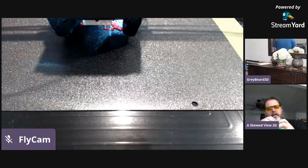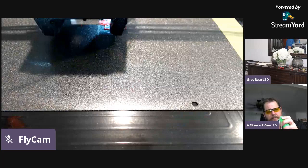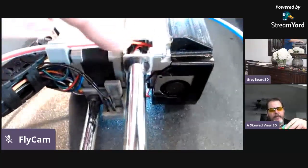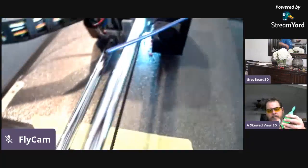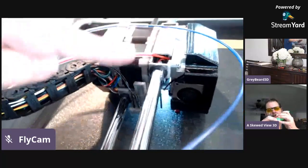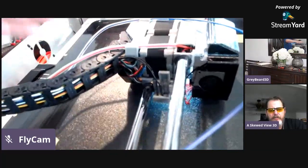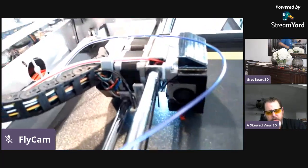It's going to be a big mess, so don't tighten it up. Yeah, whatever. Of course, it is only a little keychain, so how big a mess could it be? So there's where the filament feeds in. I'm not a huge fan of this path. It seems like it tugs it right over the rod, right into the extruder there. What other way would you bring it? I would like it to go more up and then straight down in. I want it coming in at a straight down angle into the extruder. This bend going around just doesn't seem efficient.